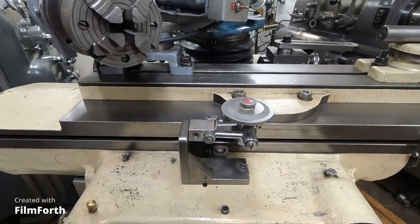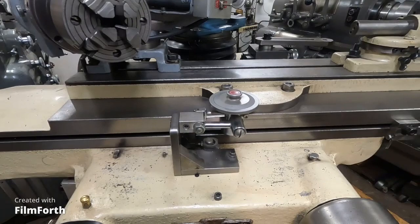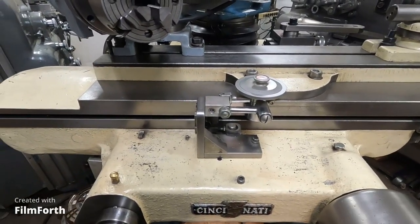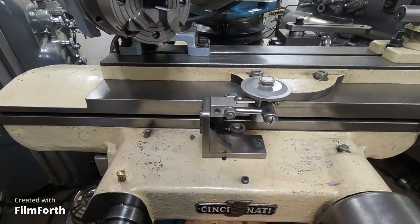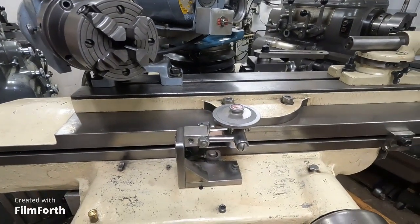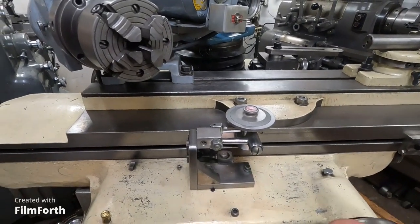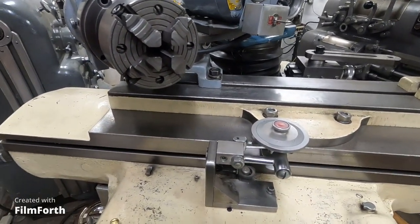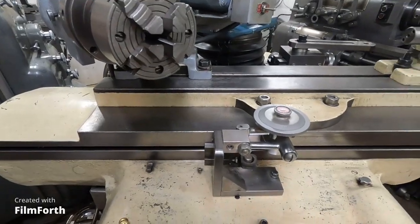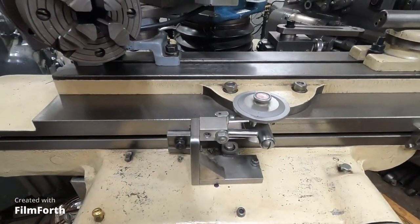So with the springs, I got a little piece of rubber there. You can actually get within your thousandths or whatever and have a load on the table and do precision cutoff or precision work where you need the ball bearing table fixed solid. So that's one way to do it. You can bring this one on over and load it against the stop too.